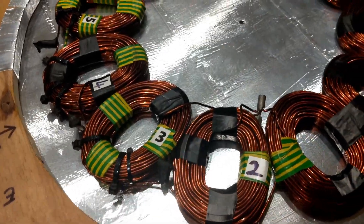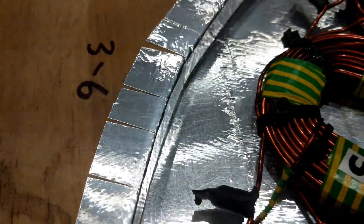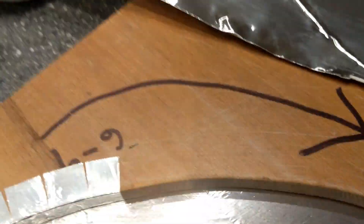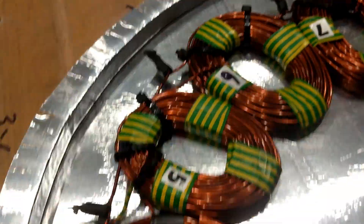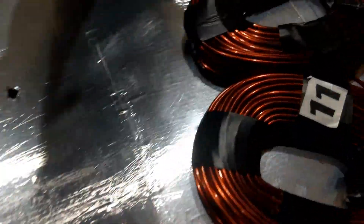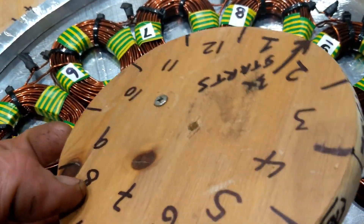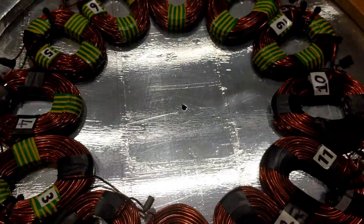What I'm doing with the inside of the mold is using four-inch metal — aluminium — tape, cut in half, so I'm using two inches to go around the edges. I'll also need to do the center. You can see the bevel on the center to make the center stay in, and the coil center of the stator will come out.